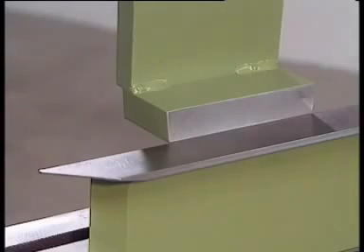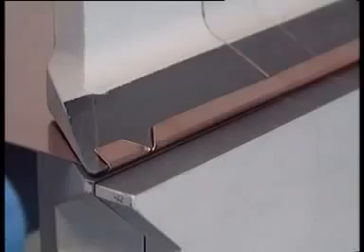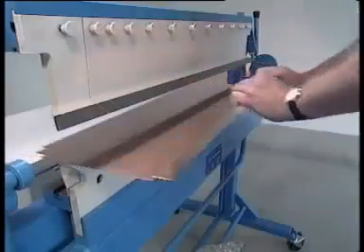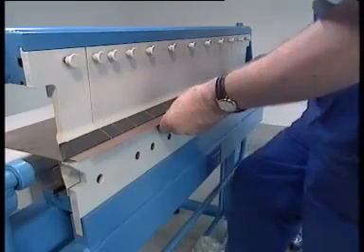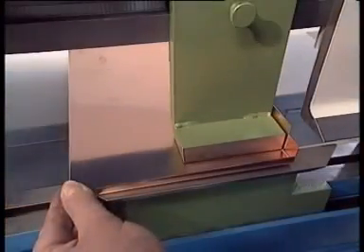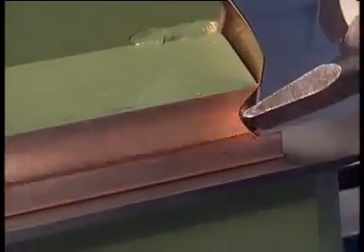One especially useful option: the windowsill patterns for making gap-free, watertight window sills. After scoring and cutting the pattern, the dripping edge is bent and then folded. Then the window edge is formed. Now the sill sides are bent up, and finally the upper segment is added towards the window edge. The bending and lower beam units are adjusted to about 0.9 inches to the drip side. Finally, the head side of the window sill is closed with a clamp fold. A flat chisel cuts the direction of the fold and turns the bending cheek upwards at the same time.